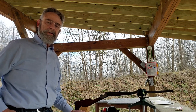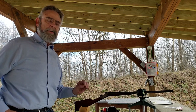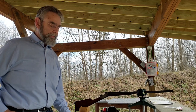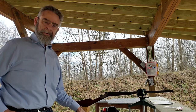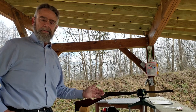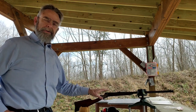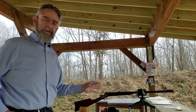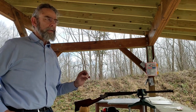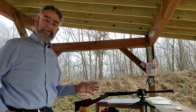You have to measure the chamber to see that, but I'm very confident that every one that was made and marked '32' as a rimfire has that extra long chamber. I've got a pretty good collection of these rifles going back from the very earliest days to the very last ones and they're all the same. So if you have a Number Two rifle marked '32,' you can shoot the 32 rimfire in it, but it will take the extra long cartridge, which is very similar ballistically to the 32-20 — a bit more powerful and a very accurate cartridge.